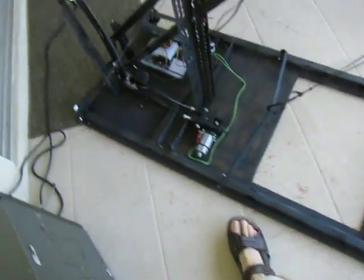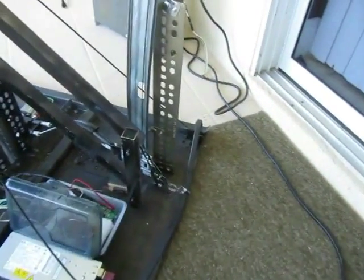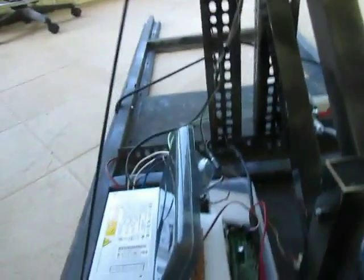This is using a car window motor that runs on a cable to a track, so it's sort of a linear actuator. It's reversible. The power supply is 12 volts — that's primarily the only voltage I'm using on it. It has something on the order of 60 amps available to it at 12 volts.